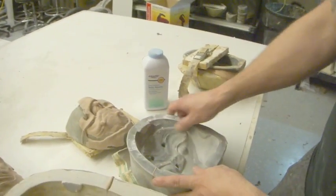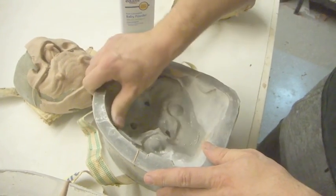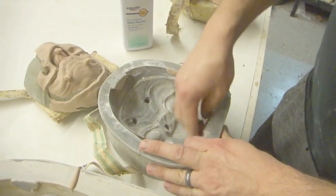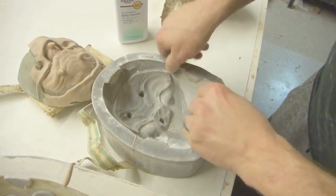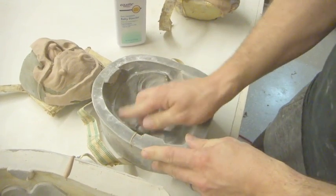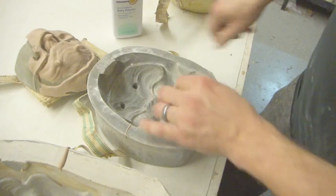And then just make sure that you go over your mold and any bits and pieces that are attached to the mold, that you rub that off before running it again. And then you need to allow your molds to cool down. If you run foam in a mold that's too warm, it can cause delamination, and we don't want that.